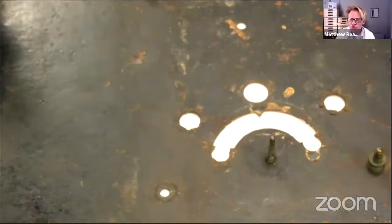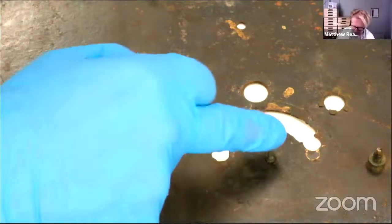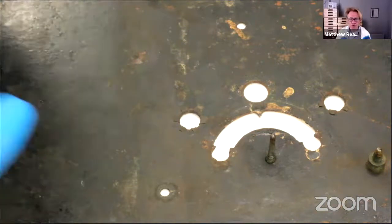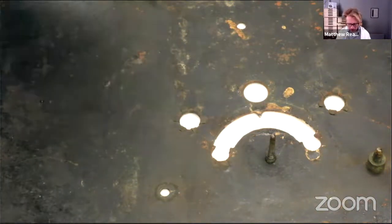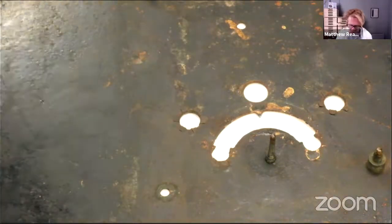Right, so it's straightened up quite well, but the rivet's loose. So again, I need to do a bit of cleaning on the other side of the dial, glue that paint round the rivet, so when we rivet the thing, it doesn't shell all the paint off. I mean, yeah, fraught with difficulty here.